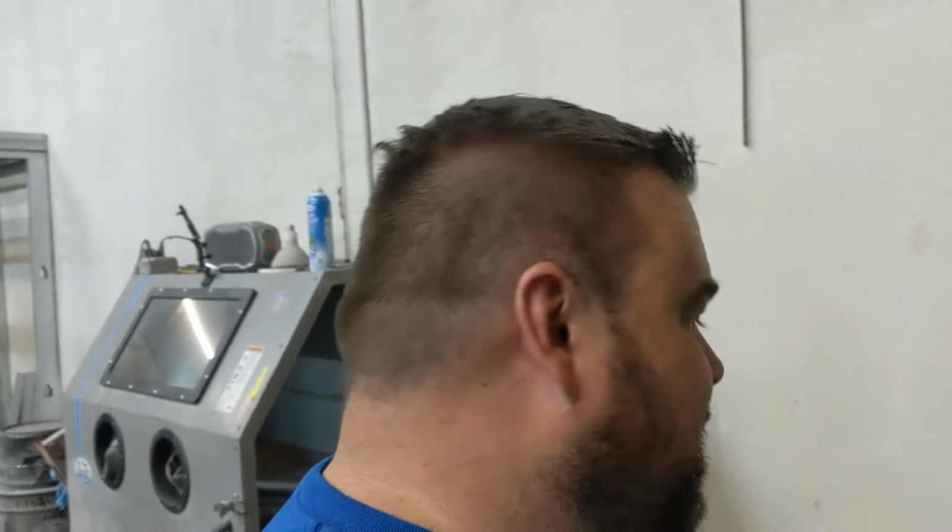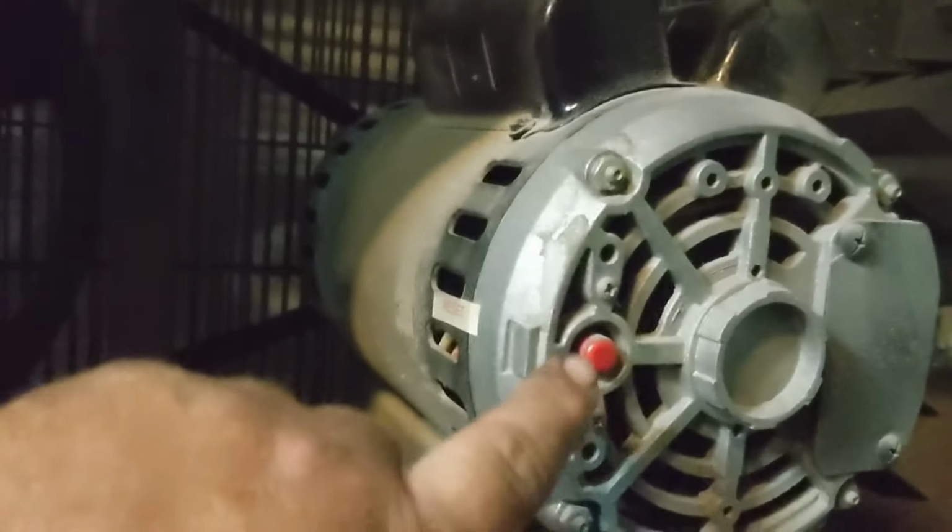Well, everything was going well, and then catastrophe, basically. I heard a weird sound from the compressor box, this box over here. Went to investigate, realized the compressor wasn't running when it should have been. It had tripped the little breaker on the electric motor, and I started doing a little investigating. I haven't exactly figured out why, but I can tell you that the pulley in the back of this thing shakes more than it should, and the pump itself makes a bunch of sounds that it shouldn't, and then it just trips the little reset button here on the motor, meaning it's a problem.